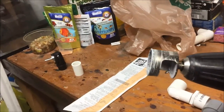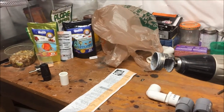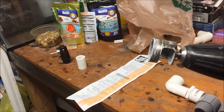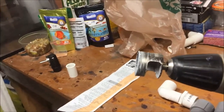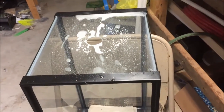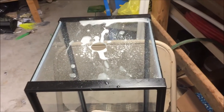I actually got the medium quality one, and the reason I'm saying you should buy the high quality is because I would get anywhere between three and five tanks out of the cheap ones — maybe seven if you go slower. I got the medium quality one and probably got 20 tanks out of it, but now I have more tanks to drill and need another drill bit. I'm going to have to invest in probably another medium quality one — about 20 bucks at Lowe's, about five dollars or less at Amazon or eBay for the cheap ones, about $40 for the good ones.